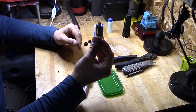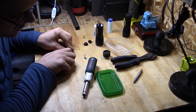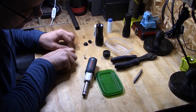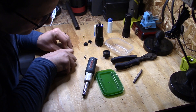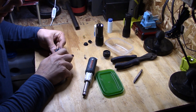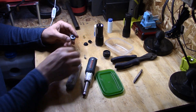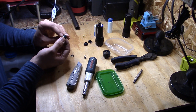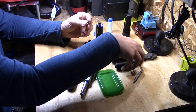You also get this spring, the rubber membrane, and the button. Put all these aside. This you can discard — we'll no longer need it. The actual ring over here, you're just going to have to cut it off. Mind your fingers — a sharp utility knife should be more than enough. What you want to do is just trim it flush, and then the 3D printed ring fits in there rather snug. The 3D printed ring is just to center the spring for later on.